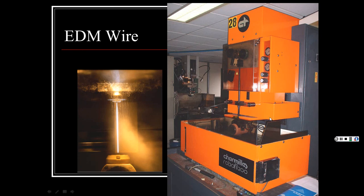And it's showing you, I always call it fish tank machining. I guess this one's wire EDM, because the whole thing is heated up, lights up. And usually they use some type of very thin brass, and there's other types too. And there's the spool of wire in that. And once you use it, it's shot. You can't reuse it. And then there's the pickup wheel for the used pieces.